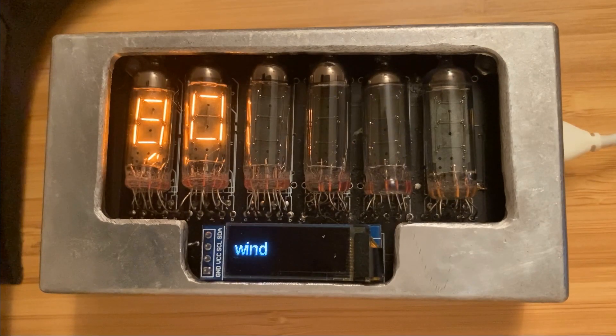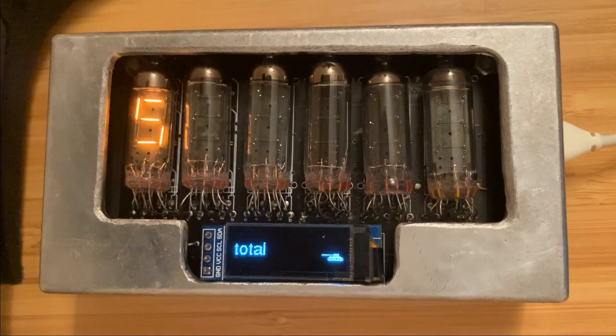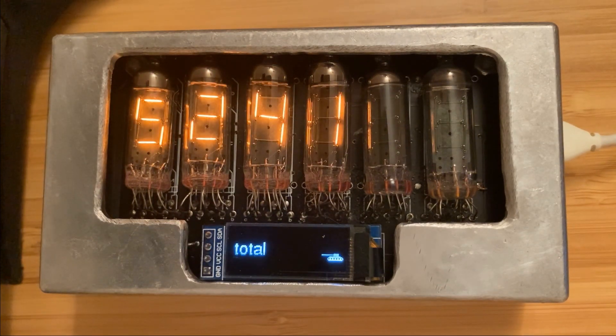This is also why I don't multiplex them. The original product brochure from RCA actually recommends multiplexing these, but just looking at them you can see there's a significant ramp-up for them to reach visible brightness — watch them turning on here. With multiplexing you're switching them on and off quickly, so they'd never actually give you a decent display. The only way to speed up that ramp is to apply a higher voltage, and RCA recommend actually running these at 12 volts: the idea being the filaments heat up quickly but then the voltage is switched off before they overheat and break. There's no way I'm going to do that — if I make a single mistake, if the microcontroller has a brownout, if there's a coding error where a filament gets stuck on, that's it — it's going to blow.